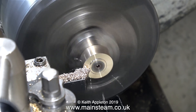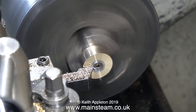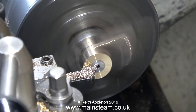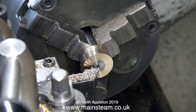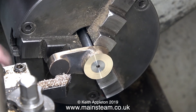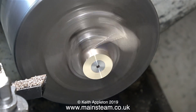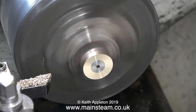I set the final cut to also machine the end of the crankshaft just to tidy it all up, which also makes the centre hole a bit smaller. A common gripe with many models is that the centre hole of the crankshaft has been centre-drilled far too large. On this crankshaft the centre hole is quite small, but on some models I've seen very large centre holes — unlike on full-size steam engine crankshafts where the centre holes are not that large relative to the shaft.